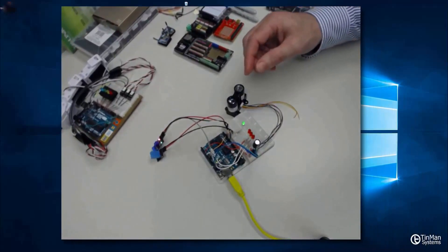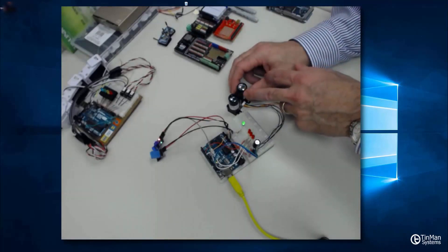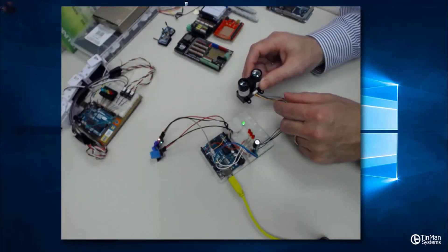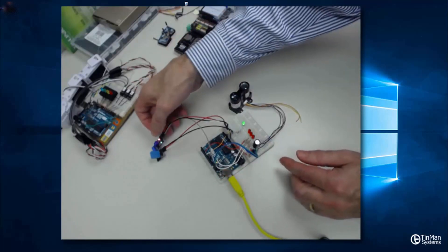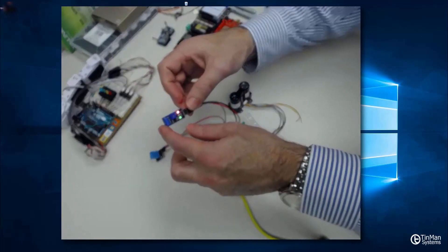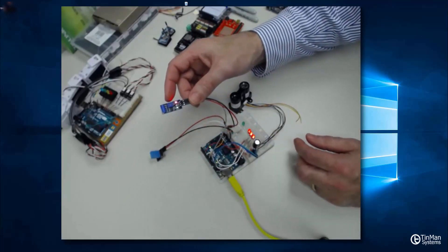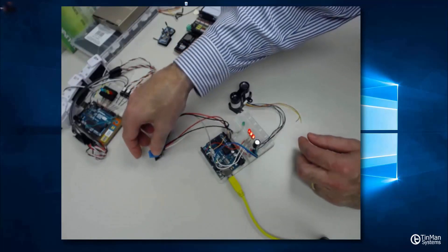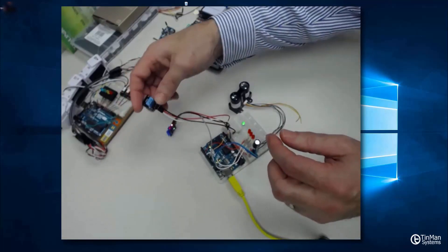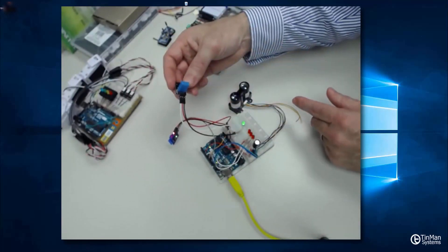Welcome. We're running an Arduino Uno with three sensors. We've got a LiDAR Lite V3 sensor hooked up through I2C, and then we've got a vibration sensor hooked up to pin 9, and then we have a standard DHT11 temperature and humidity sensor.